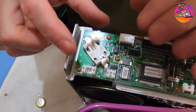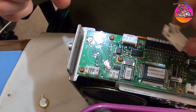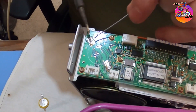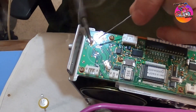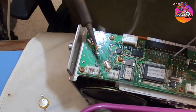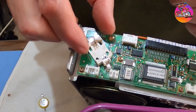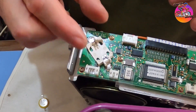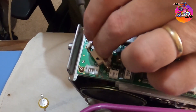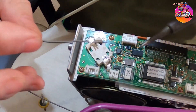It sits about there. I might put a bit of solder on there — I wasn't going to, but I think I should put a little pad of solder here. It sits like that. Now I might just reflow this solder here, just enough to stick it — left-handed soldering here.